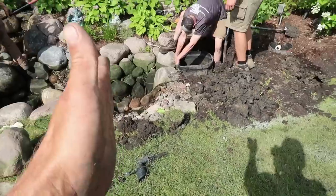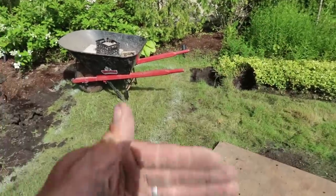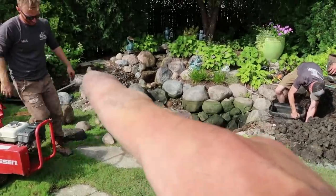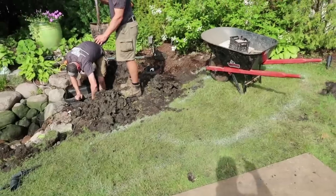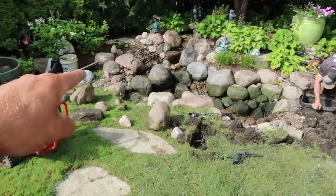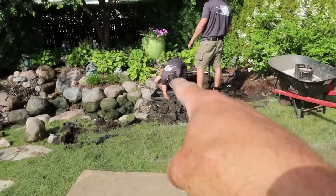That's also where our pump vault and aqua blocks are going to sit for the secondary pump. We're going to be demoing the pond from essentially here to there, exposing that liner and getting it clean — that's where we're going to be seaming the two pieces of liner. Then we're going to go 16 feet this way and about 11 feet this way, giving it a curvilinear look. This sheet of plywood will probably come out, but for right now while we're digging we're going to leave it because it's very wet and gushy back here. You can see the tire tracks sinking into the soil — this gives us stability as we're pulling wheelbarrows out with this heavy wet soil. So the second bowl out is where our 6,000 biofalls is going to go. The plumbing will probably run around the front of the pond just to make it easy, avoiding the river birch roots back there. We'll extend the two-inch line feeding the 2,500 biofalls from this way back to the skimmer. Now it's down to getting the pond demoed, starting to dig, getting our new piece of liner in, and then seaming.